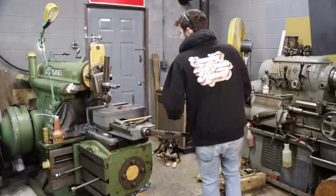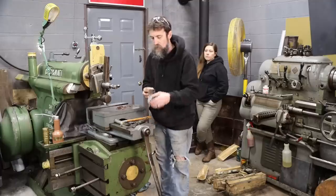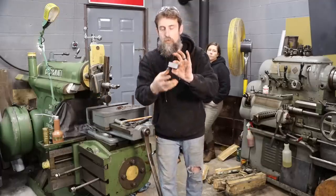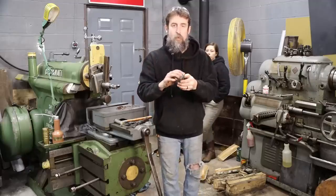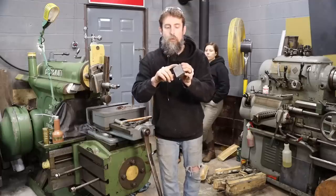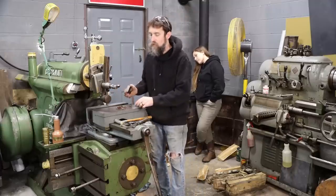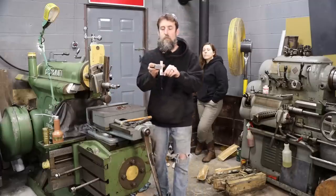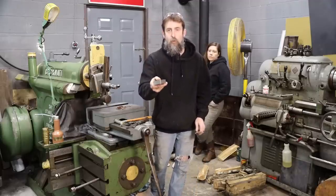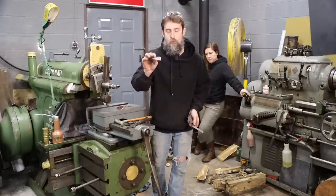All right, so I've got this block worked down on all of the edges around the perimeter of this thing. It's all the size. Now I've got to get it to thickness. And the problem is that this block was saw cut on all edges, and the two main faces on it are not parallel or 90 degrees perpendicular to the sides. So what I need to do is set this in the vise and use a square off of the ways of the vise to get true to an edge. Then I can surface one side, then I can flip it onto a set of parallels and finish plane this thing, or shape this thing, to its finished thickness.